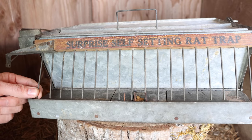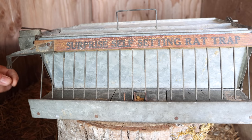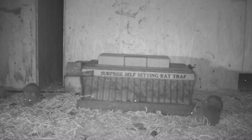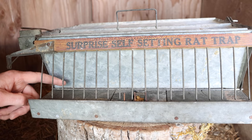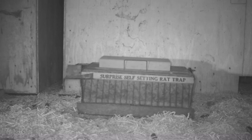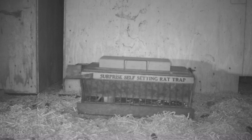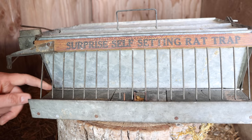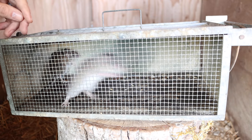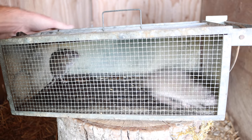Last night was a very good test and I identified quite a few flaws. The first problem: when rats ran down the alley and stepped on the trigger pad, it didn't always go off — it took quite a bit of force. Then after catching two rats at once, we discovered another problem: the rats inside the chamber were behind the door, keeping it from fully opening, so when another rat stepped on the trigger there was resistance and it escaped. The third problem is the door is on a hinge, so rats inside can lift it and escape. That happened quite often, so we caught several but only have two in the back.